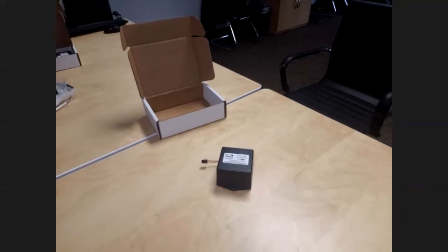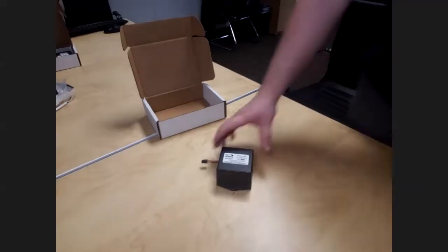So if you don't have your engine running, you've got a 12 volt or sub 12 volt battery. But if you have the alternator powering things, you're at 13, 14 volts or higher. And SkyView knows that and can see that, and it says, oh, I have enough power. There's an alternator here. I can start charging the backup battery, or topping it off in most cases, without running down the aircraft battery. So that is the SkyView backup battery.